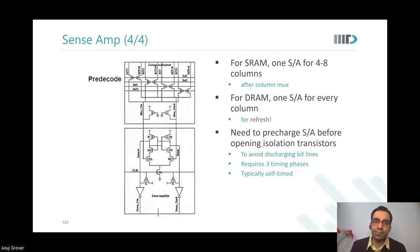Sir, you're talking about the DRAM. In DRAM, we have a capacitor. Earlier, when I was putting the sense amplifier after the multiplexer, there was a performance degradation. But now, because of the charge, because they're discharging, it becomes more illogical to place it after the multiplexer, because of the loss of charge and the added RC, maybe.